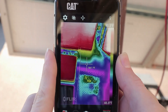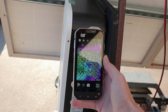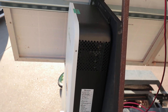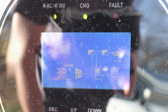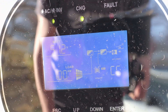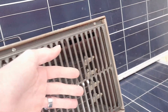Running back to the inverter, I'm looking at the output vent where air comes out after hitting the heat sinks. I was measuring 72 degrees on the painted metal there — a little bit warm. Checking the kilowatt reading now: the coffee maker is done, so we're down to 38 watts — there goes the space heater. We're only pulling a kilowatt right now. It looks like the space heater has kicked off. That's all right — we got our test in.